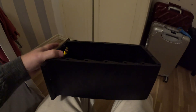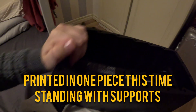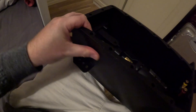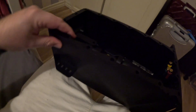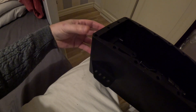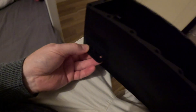It's another day and I've printed a new one. We designed it much smaller — now we only have the motor down here. I'm really happy with how this turned out; it looks neat and follows the line of the boat. I extended those intakes so it's easier to get water in here to cool the motor — it will be like a jacket around it. I've also redesigned it to be a little bit modular, the way I work with software, because I know I'm going to need something to move the jet thrust in different directions but I haven't decided how yet.